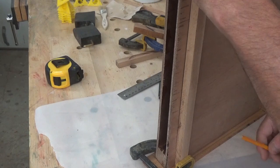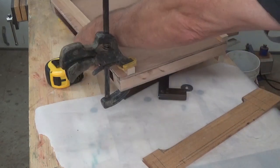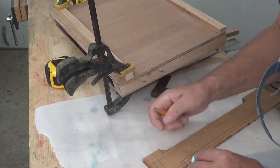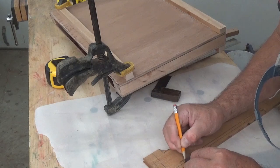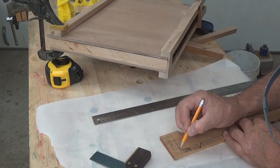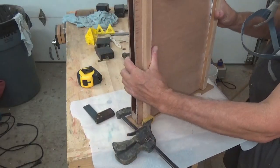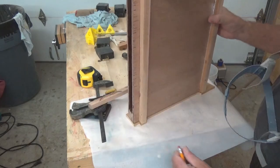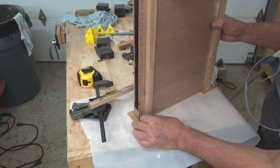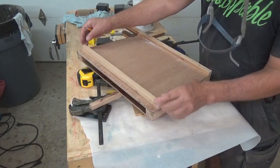With the log on the bottom on the port side sitting there, that is where the line is. We'll draw a curvature here: there's a 90 degrees and then a bit of a slope up over the keelson, around the framing, and then the curvature. So that's going to sit on there like so. I don't think I'm going to glue this one on yet — I'm going to glue that one on when it sits in the boat.